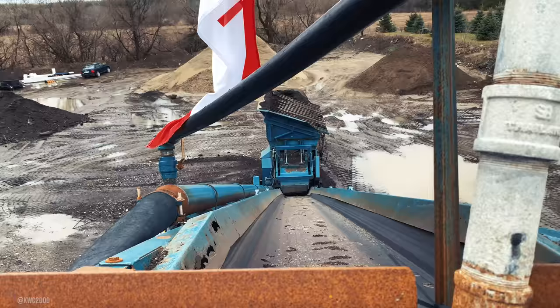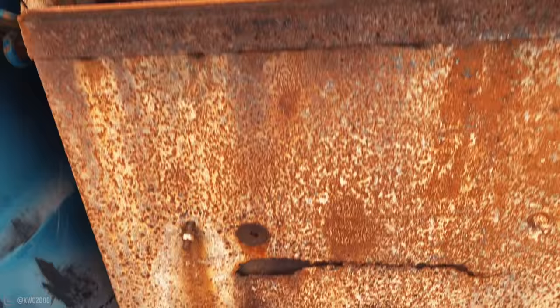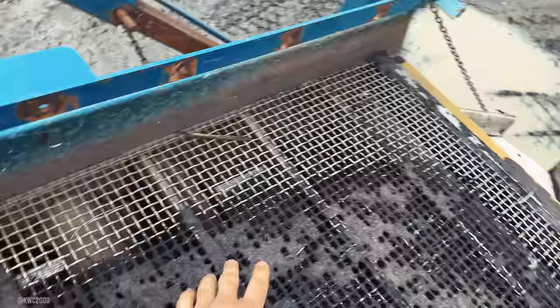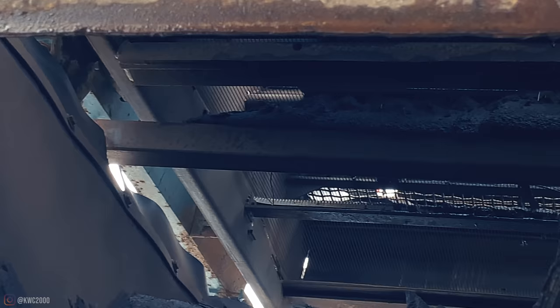Dirt comes up from the hopper down onto our main primary deck, which is a half-inch screen. The dirt comes off that belt, drops down onto this half-inch screen, and anything larger than half an inch gets rejected and thrown out. The rest gets thrown down into the bottom onto eight-millimeter harp strings — I'll show you guys a close-up of those. These are the eight-mil harp strings on the inside of the unit.